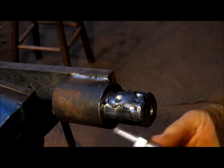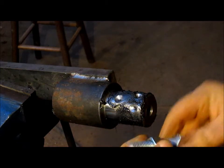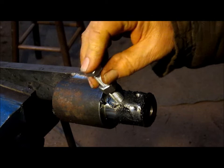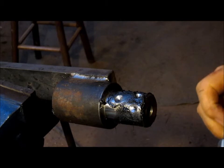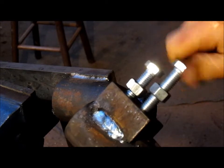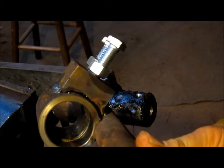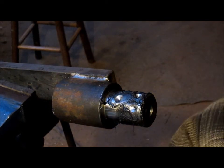All right, so we've taken a couple of 2.5-inch, 1/2-inch bolts. We've tapered the end so that it will fit into the divot that we've drilled into the shaft. And you can see it's a perfect fit, 60 degrees, like the end of a drill bit. And then we threaded or tapped a couple of holes in the pivot. And I put a little grease on there because this is going to be the assembly moment.